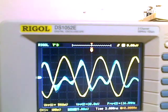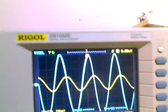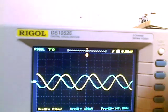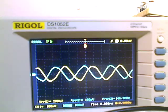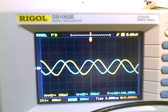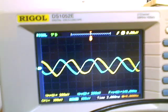If we just wind up the frequency a bit — let's go up to 147 MHz — you can see that they're basically the same amplitude there. I wouldn't trust what you see on screen all that much because it is a 50 MHz scope being asked to operate at 145 MHz, but nonetheless...